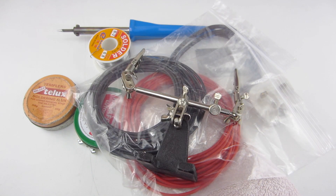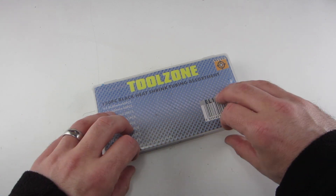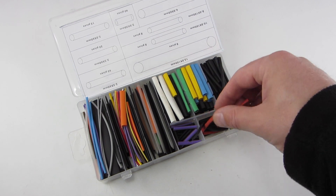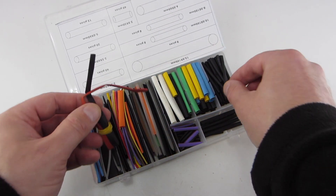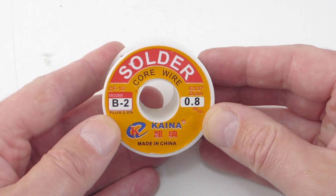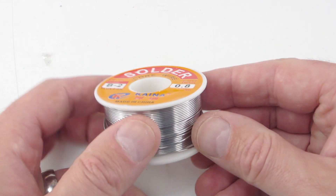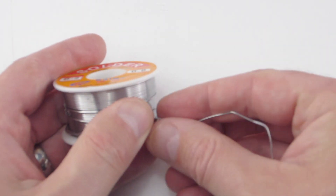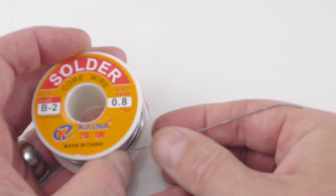One of these helping hands can be useful. Often when you're soldering you won't have enough hands and it just makes life a little bit easier. You'll also need a way to insulate your soldered joints when you make them — heat shrink tubing is ideal. You can get kits with different sizes and colours very inexpensively. Now, solder is pretty self-explanatory. Most of you will have seen it before. Just make sure when you're buying it that you buy the stuff meant for electronics use and not plumbing or any other application.